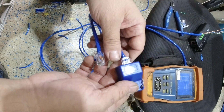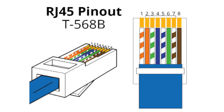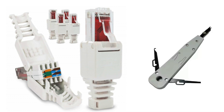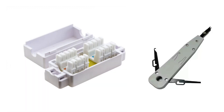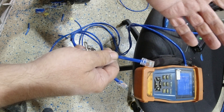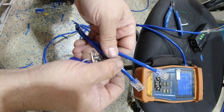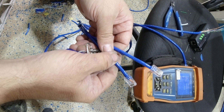The configuration I used was white orange, orange, white green, blue, white blue, green, solid green, white brown, and brown — and that seems to work pretty good for me. There are better connections too where you can use a punch-down tool — I don't have mine with me today, but they push down and cut at the other end. That's an option. There are also better connectors you can pay four or five dollars for where you can feed the wires in a bit better. I find these cheap, effective and easy enough to use. Leave your comments down below — thanks for watching.